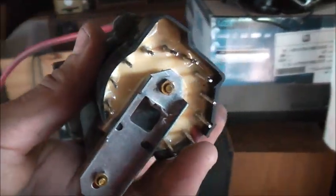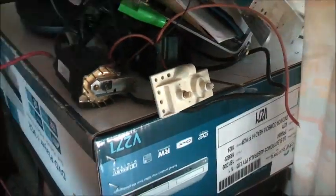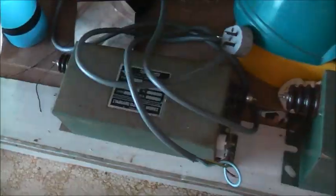So this is probably a special purpose type of flyback, as this had a monitor input. You can get relatively thick windings in there. I'm going to keep that with the original transistors on that heatsink and leave this as it is. Shouldn't be too hard to rig this back into the circuit to drive that flyback. It's got a 2 kV MOV there too. So one day if I can get any time, I should be able to make use of those original transistors on that original heatsink to drive that original flyback. I'll put that aside for now. Attempt to salvage parts of that another day.